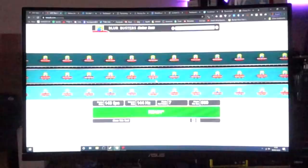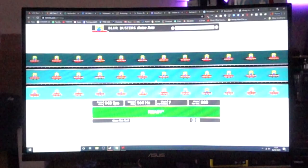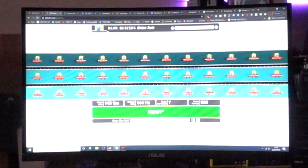ELMB is the process of strobing a monitor's backlight to reduce motion blur. I recorded some high-speed footage of this happening — a bit of a trigger warning for any epileptics as it gets quite flashy — but you can see it: the panel turns on long enough for your brain to see the image, then turns off until the next frame is ready. When done right, this can give a whole new level of clarity and sharpness, especially in games, even rivaling old CRT displays.